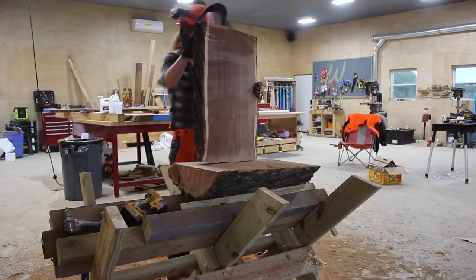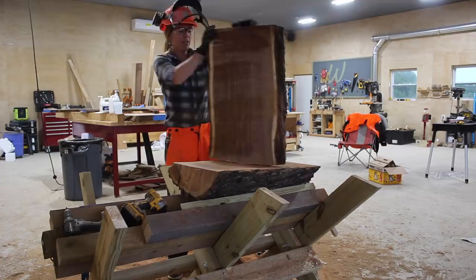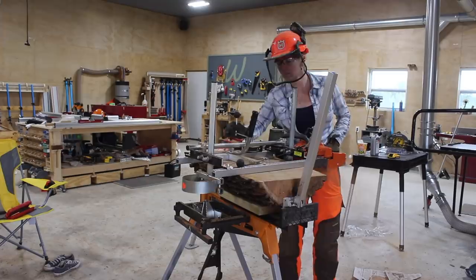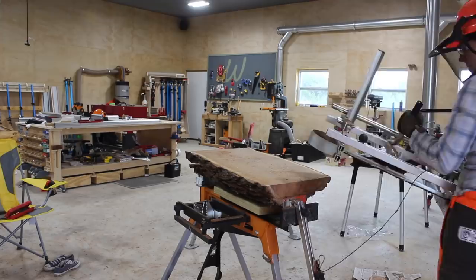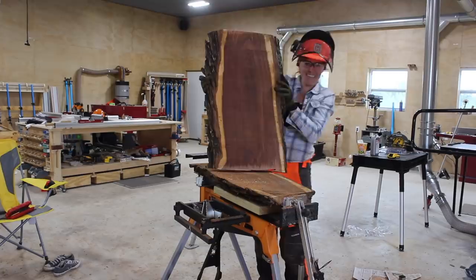See what this thing looks like — too much slab, oh my goodness, and it smells so good. Something else I did when the log got smaller was use the lock jaws and my super jaws — a set of jaws with blunted teeth specifically designed for grabbing logs. A helpful tip I got from Instagram: instead of placing the log level lengthwise, place it downhill gradually so that gravity can help you while milling through it. Oh my goodness, look how pretty that one is — it's real red, like this one. Gorgeous.